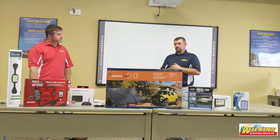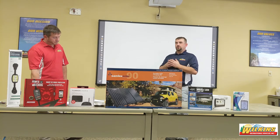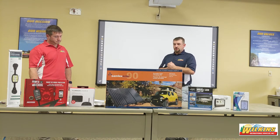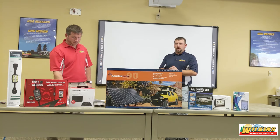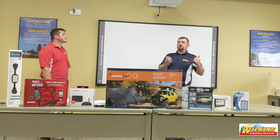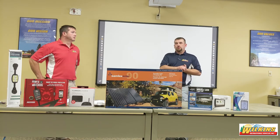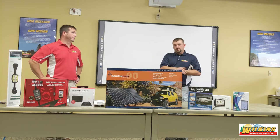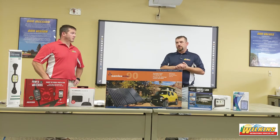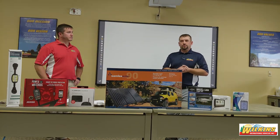The big one is the residential refrigerator. Just keep in mind: if your tow vehicle's charge wire is hooked up with the relay and fuse in place and is charging, that charges your battery as you go down the road, which in turn keeps your refrigerator cool through the inverter. It is not going to cool the refrigerator if you try to run it on inverter alone — it will last about three or four hours and then your entire coach will be dead.